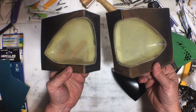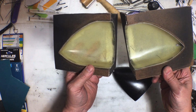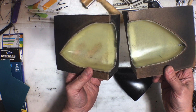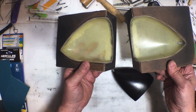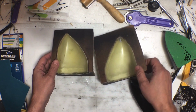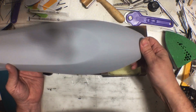There you go. So I'll just lay in, I want it to be about 3 millimeters thick. So I'll probably do about, I don't know, 9 to 10 layers. That'll actually be less than 3 millimeters. Probably 8 or 9 layers will be perfectly good enough. And so I just have to prep these, put some mold release agent in it, and then we'll get those pieces done. I'm not going to do that this video because, like I said, this video is already way too long, but you already know like what the end result can look like.